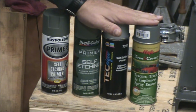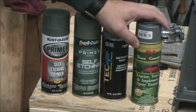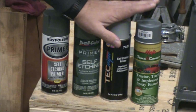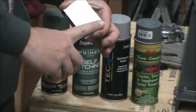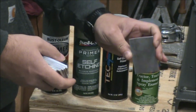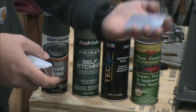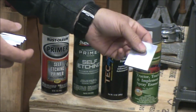Like the primer coat on an airplane, at least for parts that aren't getting painted, when you coat everything, all the aluminum components, should be almost translucent. So each one of those will get painted, probably just one surface. That way you can kind of see a control on the back surface, because one of these tags is going to be sent through a corrosion test where I expose it to salt water. And it won't be in the salt water, but I'm going to put it on a tray above the salt water and then keep the heat at about 35 degrees Celsius.